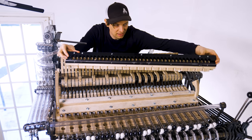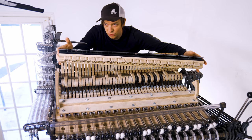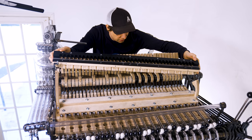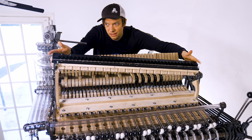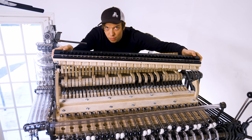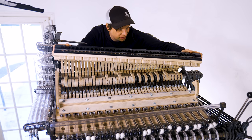This marble divider sits at a compound angle — it's angled in three directions. The way I'm going to fit this is that I designed it oversized, so right now it doesn't fit in. I have more material on both sides than I need, and I'm just slowly going to remove material — measure, remove, measure, remove — until I can slot this in.